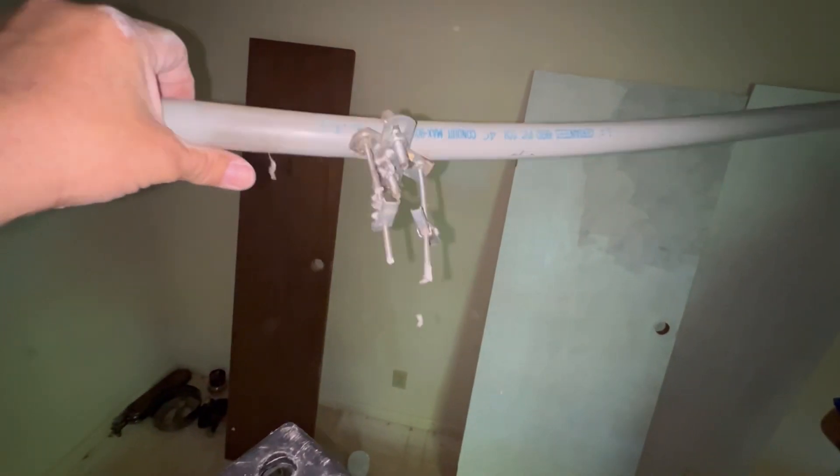That's mint, dude. Now obviously, had that been a steel conduit, it wouldn't have sagged and been pulling out of the ceiling like it was — but it still wouldn't have been right. Just get the right stuff: UL listed and approved for the use. That's what we're supposed to do. That was probably a homeowner special from so many years ago.